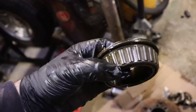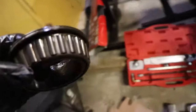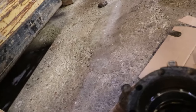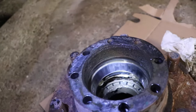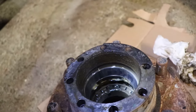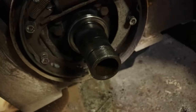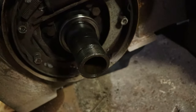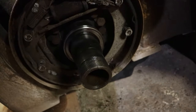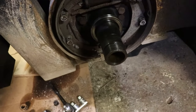I've taken a bit of time to think about the situation. The bearing surfaces are okay in the hubs — it's got some funny wear on it but it's not pitted or damaged by any water or corrosion. So I'm just going to put this back together tonight and let it drain. Tomorrow I'm going to overfill it with 80-weight oil and just flush the heck out of this to get everything out. I think I've caught it before any damage has happened, so this is where we're going to shut her down for today.